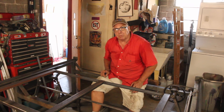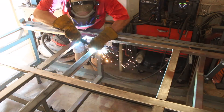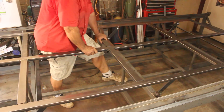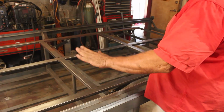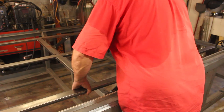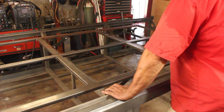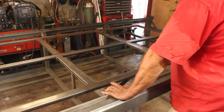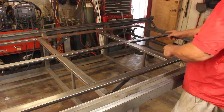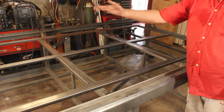I think if I tie these two links together in pairs with this heavy bar, that should straighten things out and make it so I can use a single screw to jack the entire table. Now with those links tied together, if I lift right here on the side the whole thing moves up - it's pretty stiff but it'll wear in. The next step is to put a screw jack between the center and this point here so the pressure is right in the middle and it stays level.